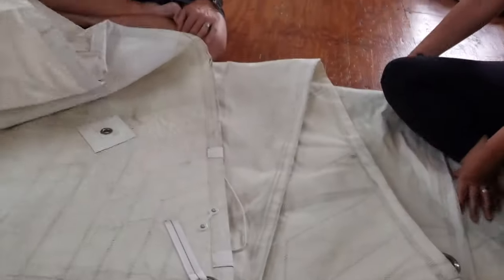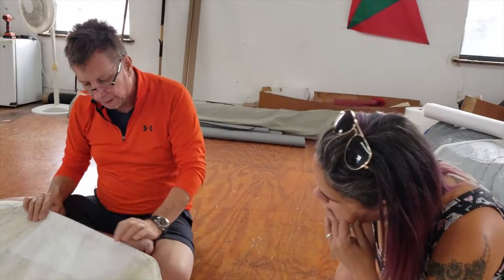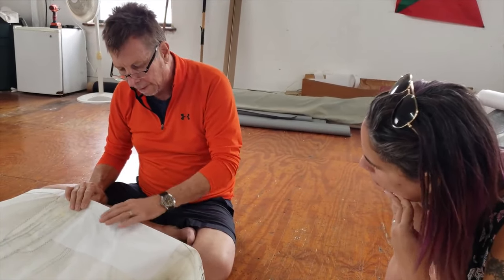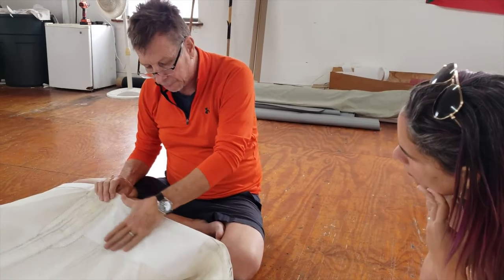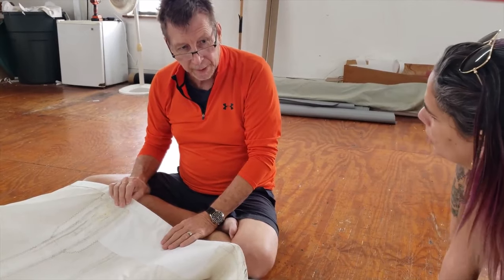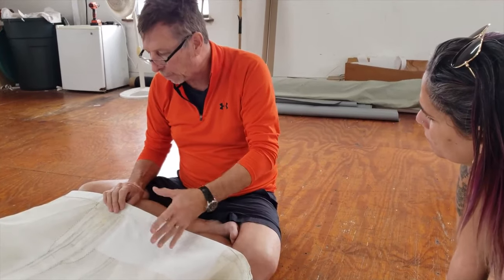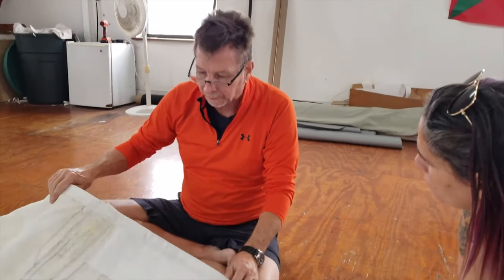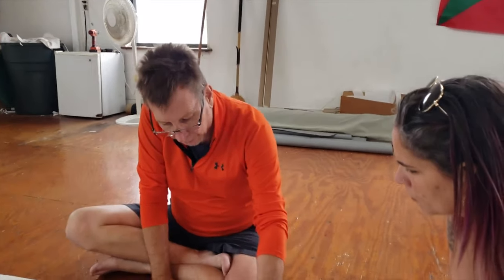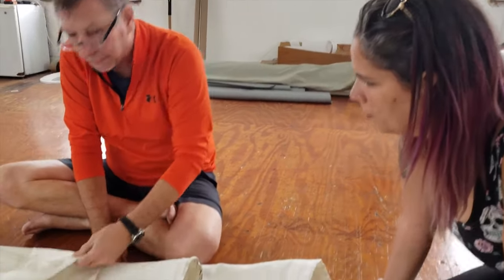When your Dutchman cord came up there was a little bit of chafing on the leech right here, and I started to see a couple little vertical splits. Not enough to really merit any kind of big repair, but I just backed this up with 2.2 ounce adhesive-back insignia cloth. It's kind of a reinforcement, not really a repair, but a reinforcement just to give this area a little more rugged quality because actually these little splits started to appear underneath of where I was putting this. So it's taken care of at the same time.